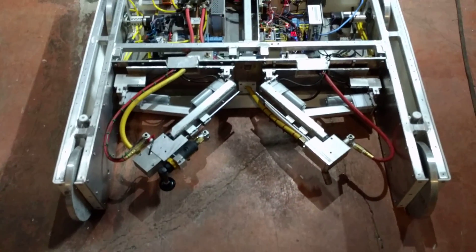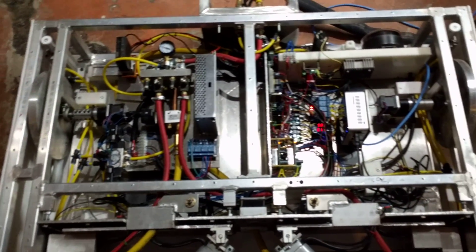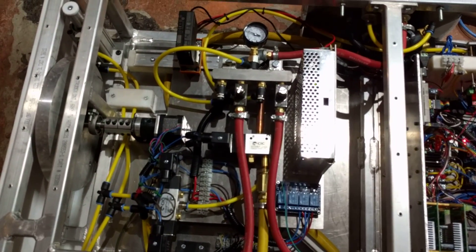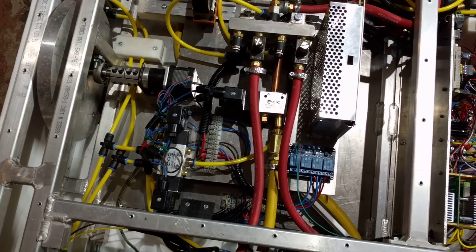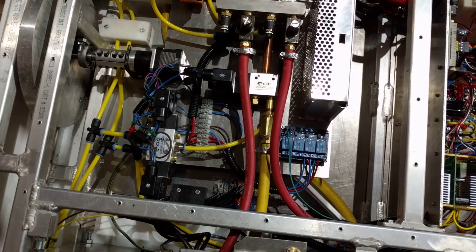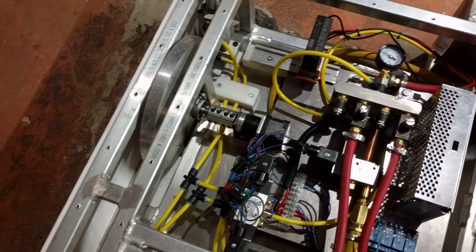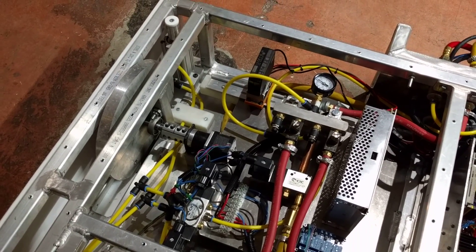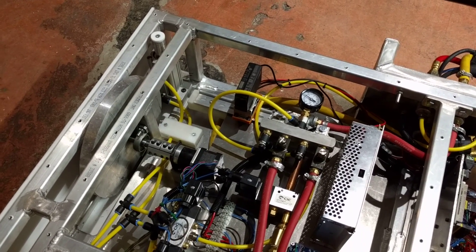There's quite a large working area in between the robot. I've got the covers off right now because I'm doing some work to it. Here's the power supply unit and a lot of hydraulics, solenoids, relays and junk. These relays control most of the solenoids and some of the lighting. The drive motors — the machine is reversible, you can flip it upside down so it drives on top or bottom. It knows its orientation so it corrects directions and arm offset corrections automatically.